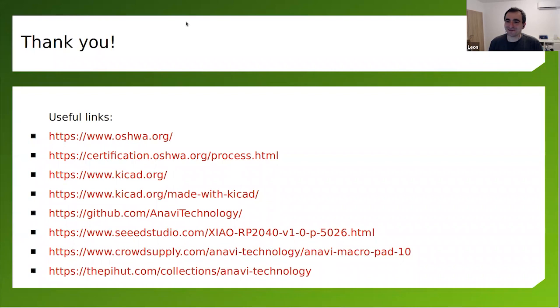There are a lot of mistakes that you can make, but the cool thing about KiCad is how it works: you do the schematics first. After that, you select the footprints. Each component should have a unique ID, and then you run a check. It's an automatic check, and if there's some really basic mistake, if you have forgotten something, and this happens all the time, KiCad will say, hey, wait a minute, fix this. You're going to fix it. And then you go to the PCB view where you make the actual outline of the board.